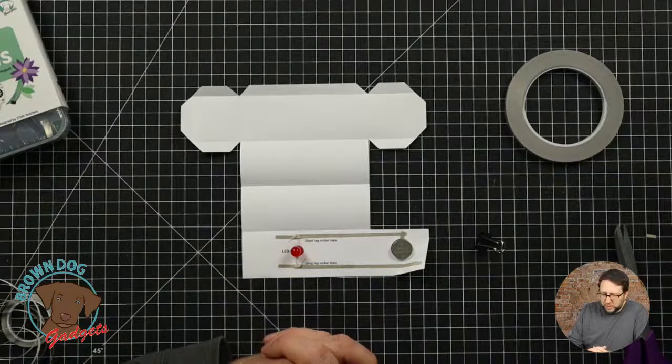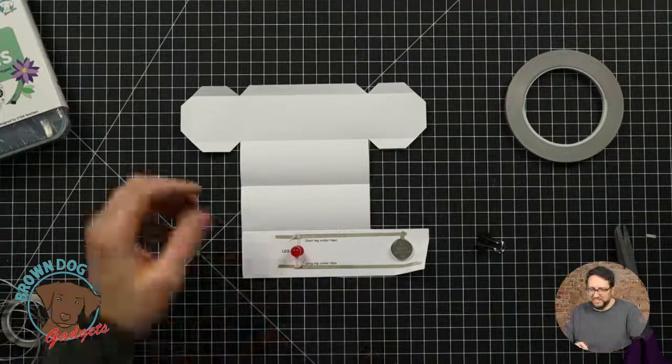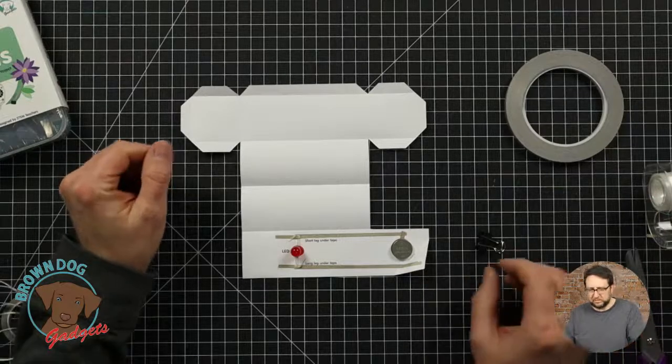And also, using blinking red LEDs would totally work well. Blinking would be great. Just from experience, 2 to 3 LEDs off a single coin cell battery is as many as you should really try. After that, they start going dimmer and dimmer. If you want to use a AA battery pack, you could power 50 or 60 of them, but that's a little silly. But yeah, 2 or 3 would totally work on this as well. But one looks pretty nice, as we saw in that opening video clip.